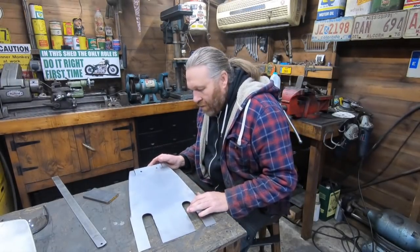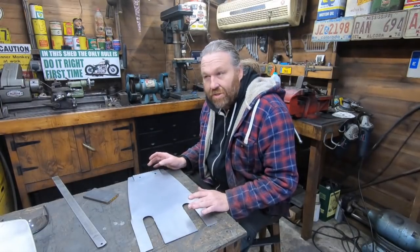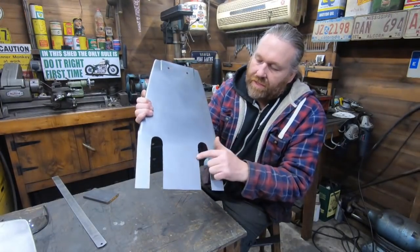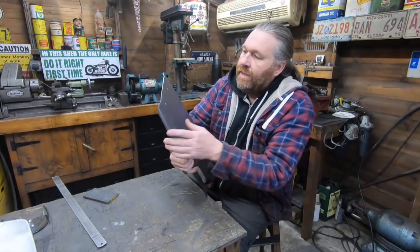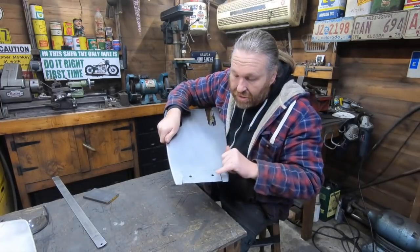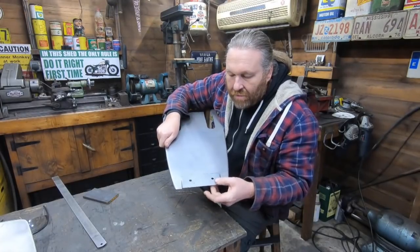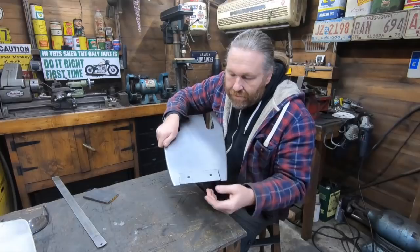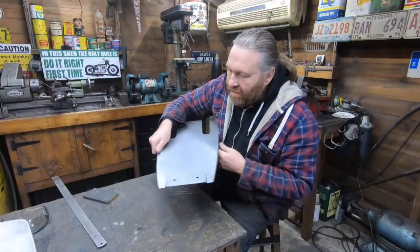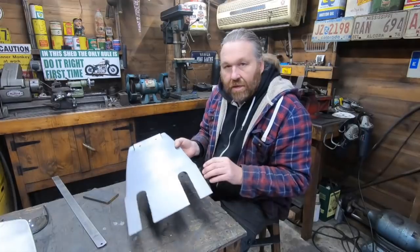Guys, right, part two of the under tray. A couple of little adjustments before we get cracking on the next bit. Got to widen these a bit to clear the frame, and this step I've put in just needs doing a tiny bit more. It's just holding off the surface that this butts up to, so when I do it up, this is trying to bow. It's only slightly, but if I just bring this up a tiny bit more, that should cure that. So they're the first bits I'm going to do, and then we'll get on with shaping these sides into the little panels I've made.